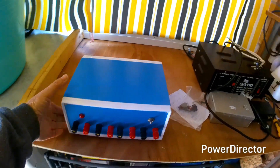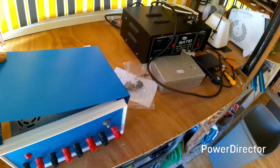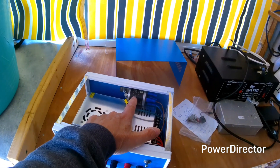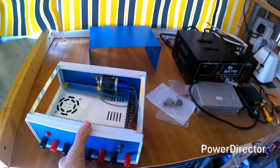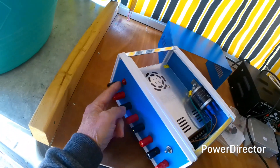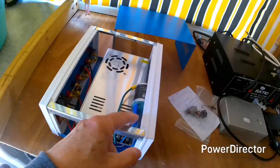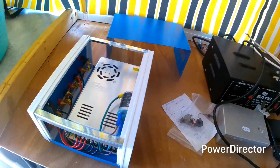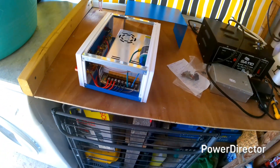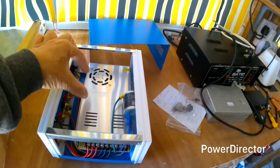Let me lift this up — I bought this RS mains filter to put extra filtering on the mains. I scrounged this on/off switch from my neighbour, and I already had this panel indicator. So with all the extra bits it's cost me under £25 so far. The only thing I still need is fuses on each of these outlets, so I need a four-way fuse box.